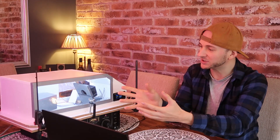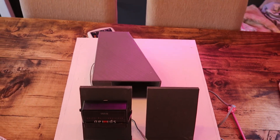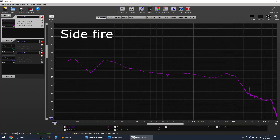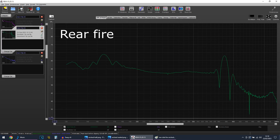I couldn't actually decide what orientation to have the box in the cabin, so rather than just guess and maybe miss out on some performance, I measured three different positions. One with the box facing the side wall with the horn gradually getting further away from the side piece — maybe extending the horn a little. One with it right up against the back of the cabin, and one with it firing forwards at the sensor. I opened up Room EQ Wizard and ran a sweep, and the one firing to the back generally gives the louder response across the board, with better response on the lower end due to the Helmholtz mode and possibly a little quarter wave mode. So, horn firing at the back was loudest. Here are some demos.